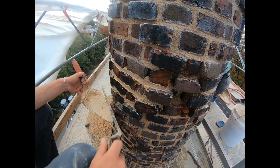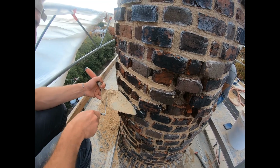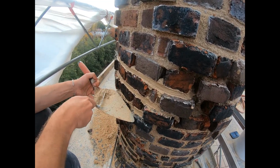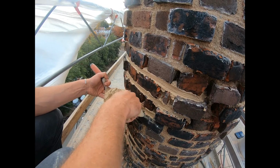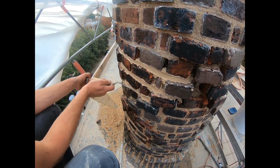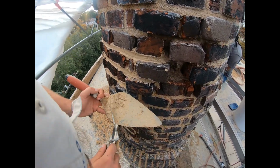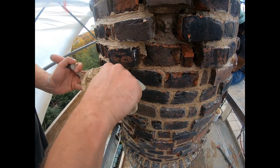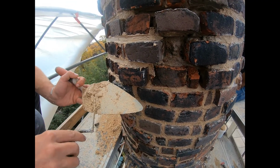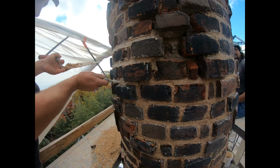It is important to note that the surface of the brick within the joints must be completely clean and free of any dust or residual mortar. Successful repointing depends on the bonding of the mortar to the walls of the brick. The new mortar will be at the mercy of the daily expansion and contraction of the masonry, so it relies on full adhesion for the entire depth of the mortar joint. The old mortar is cut back to a squared surface within the joint to allow for full purchase of the new mortar on the brick.